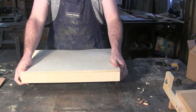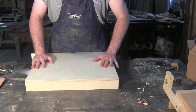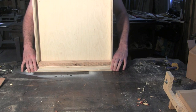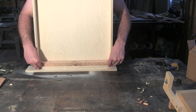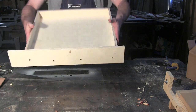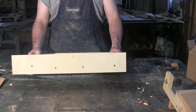That makes a nice rigid box that I can clamp down to my table when I need to. On the front edge where the fence is going to attach, I went ahead and put in a 1-inch by 2-inch strip of oak, glued that in there to make it more rigid. And then on the front, this is a 24-inch by 4-inch piece of plywood.